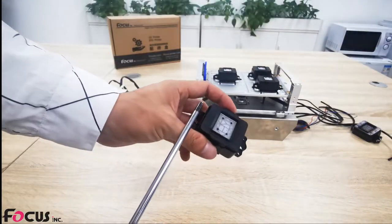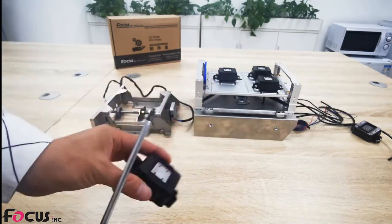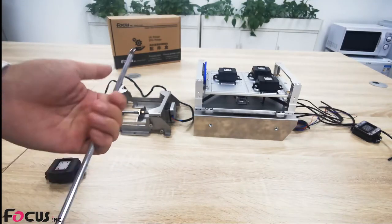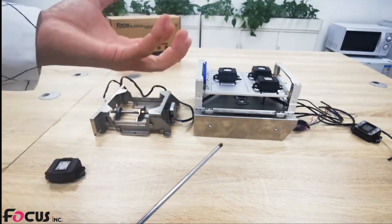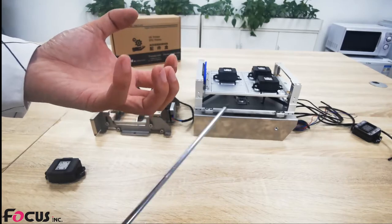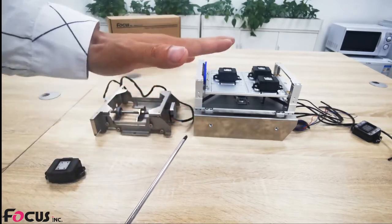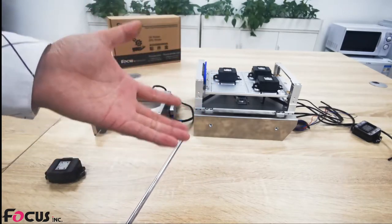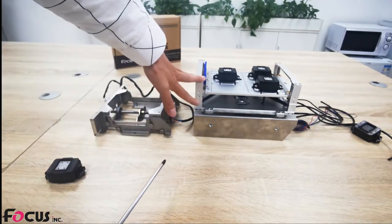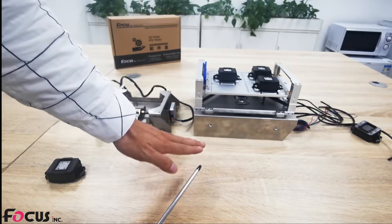After figuring out a good cap, that is only the first step — it is not enough. We then require a good design for the cap station motion system. The cap station needs to move up and down: moving up to seal the print head for head cleaning or flushing, and moving down to release and pump out the waste ink to the wiper. A good cap station system requires very high precision movement from bottom to top.